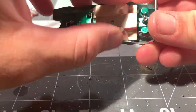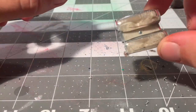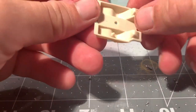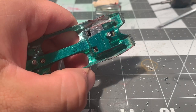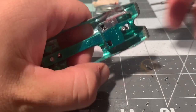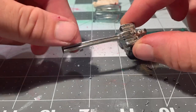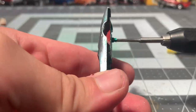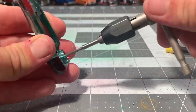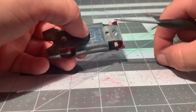We'll pull it apart — the interior will pop out and so will the glass. You can see the original Spectra Flame green; the interior is in good shape but the glass has some cracks in it. We're going to keep the glass. We'll grab a small flathead screwdriver, push these tabs back, and the engine will fall right out. Off camera, I drilled the posts out with the small bit and we're going to tap it with the 2-56. Now we can fit the base together with the screws and see if it fits as well as it should.